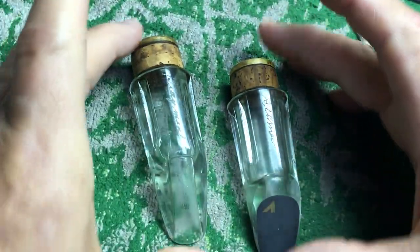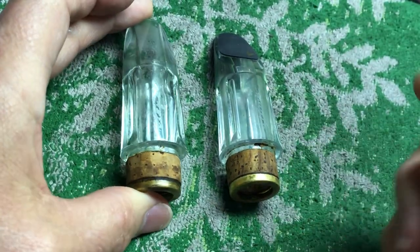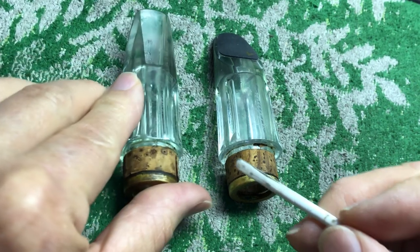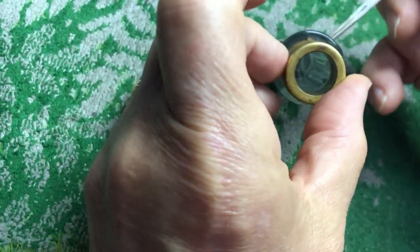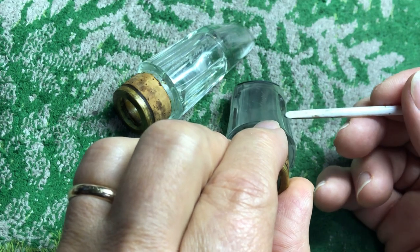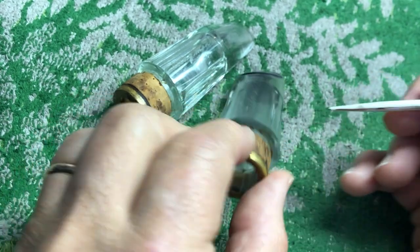Now, this is made with two side molds, the best I can tell. The way I tell is you can't see a seam down the middle because they clean that up, but you can see in the shank there's a little seam on both of them. And when you flip them over, you can see a seam here and there, and the rest they polish down so you don't see it. So the two halves come straight out. These flutes, even though they look like they'd be radially out from the core, are actually made so that horizontally they can pull the mold straight out and it'll draft properly, three flutes on each side.